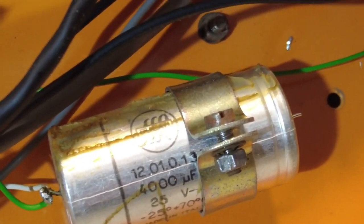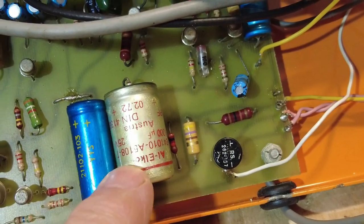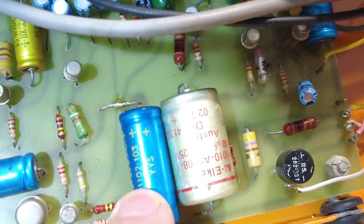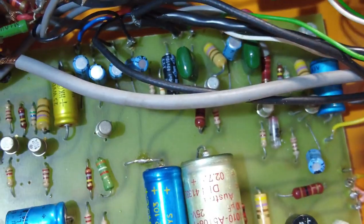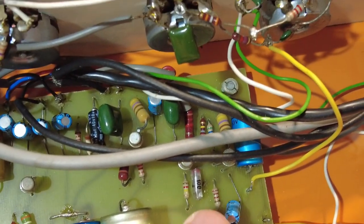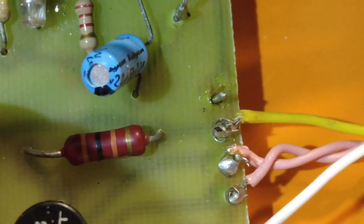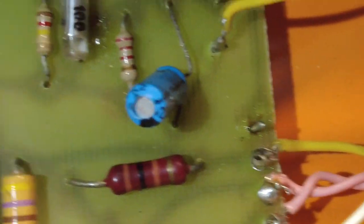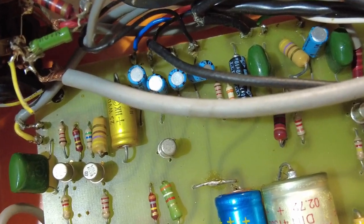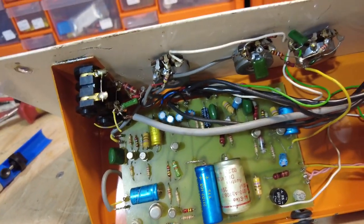I think that one is 4000 microfarad - well, it's going to be 4700 microfarad on there at 25 volts. You can see that's quite big for a 25 volt cap - they're much smaller these days. We've got 250 microfarad there also at 25 volts, and I'm not sure what that one is - 47 I think. Then we've got this one which is 2.2 microfarad, another 47, and then these are all 2.2s. So we're going to change all of those.